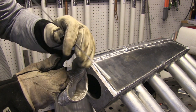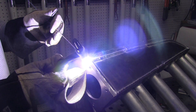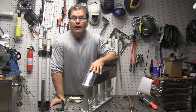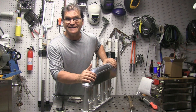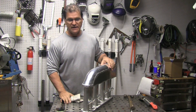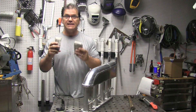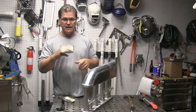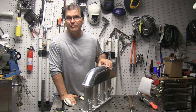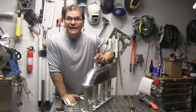A flex head torch really comes in handy. I bend it a little bit and it helps me keep the right angle. You can see I can just prop my TIG finger where there's no great place to prop and just twist my wrist around without my finger cooking and make the weld a whole lot better than I could without it. An aluminum part like this gets hot really quick and it's hard to find a place to prop. You can cut a four-by-four wood block and use that for propping, but a TIG finger will help you make a nice long run without stopping. I've got the TIG finger and a TIG finger XL — the XL is big enough for most people to put two fingers in and it's thicker and more heat resistant. I didn't really need the XL for this job; the regular worked for the whole thing. Hope you got something out of it — we'll see you next time.